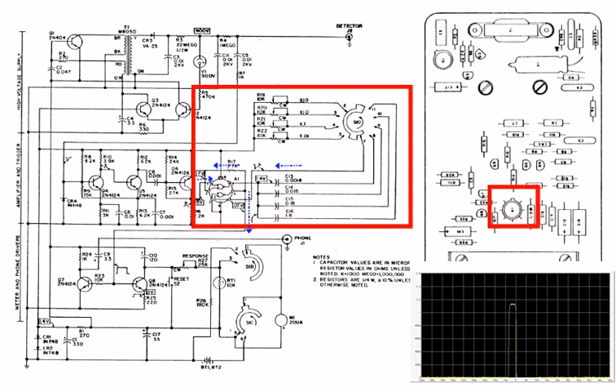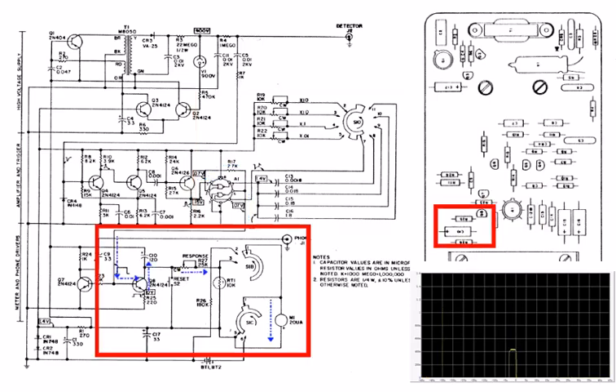The width of the resulting trigger pulse is controlled by the RC time constant of the selected range. This pulse is for the times 10 range and the second is for the times 1 — you can see how it stretches the pulse. The trigger pulse is then fed into the driver transistor Q8, which is normally off so no current flows. When Q8 gets turned on by the pulse it charges the capacitor C10, which then gets discharged through the meter M1.